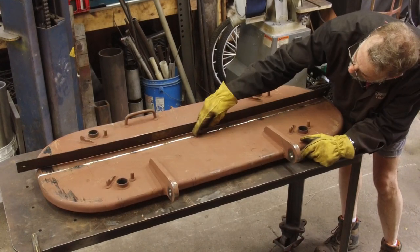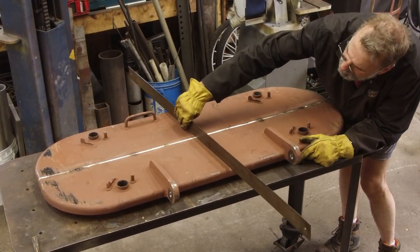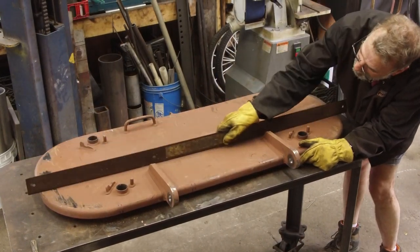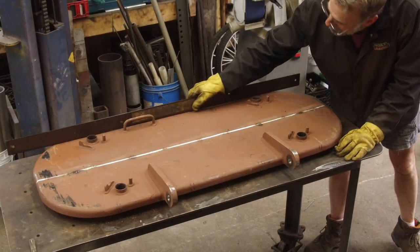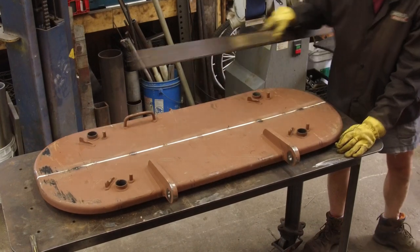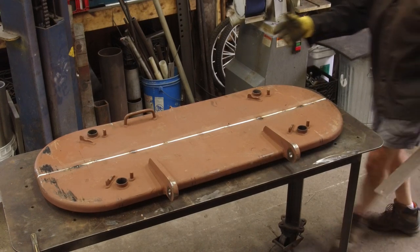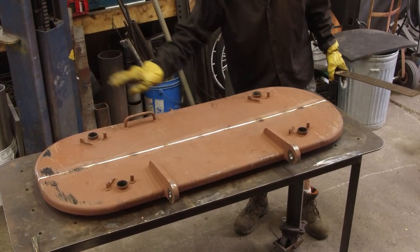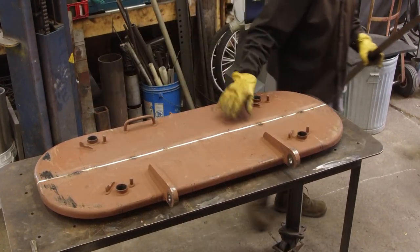Okay, that's about what we had. I said we had a gap in here, and that's pretty flat that way there. Remember, you have to make contact on a long distance between the upper and lower dogs. So this surface has got to be making contact before those dogs come in, because of the way it's going to dog the hatch to create that seal.